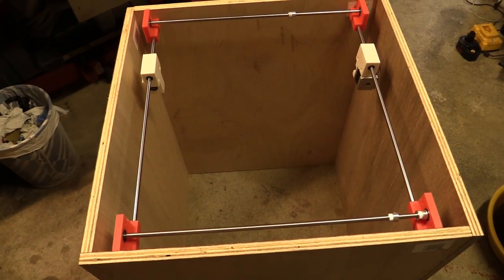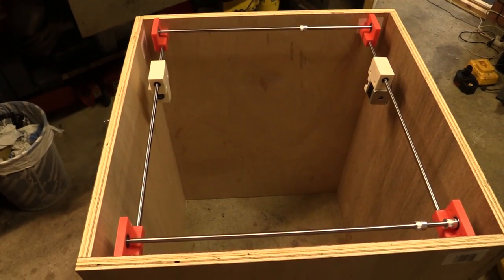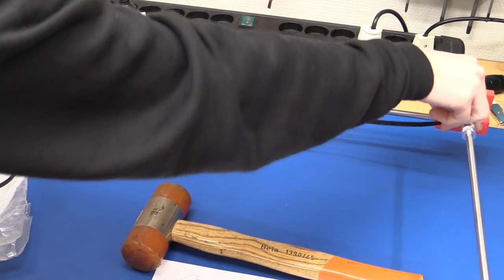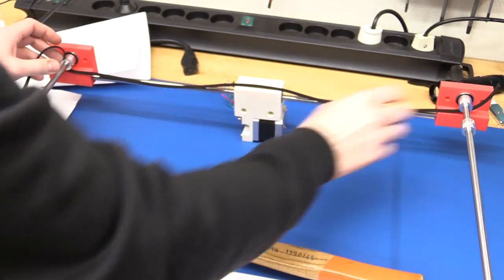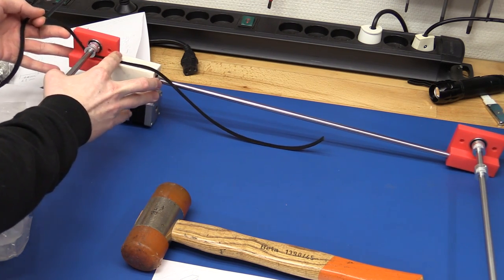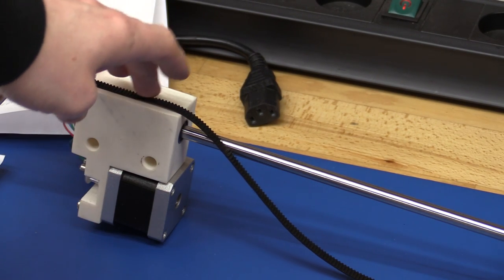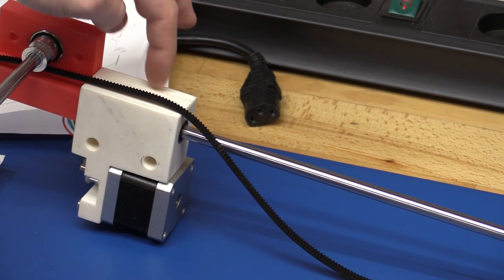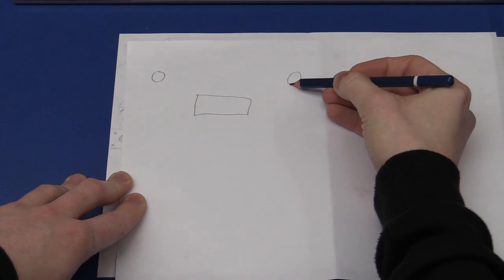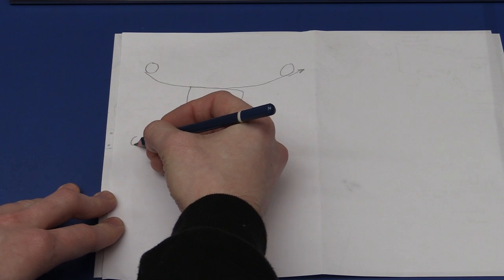I finished the box and it seems to fit. I'll pull this back out and look at how it all fits together with the belts. What I want to show is that when the belt engages these teeth it should be at the same height as this, so when the block is pulled sideways the belt stays level — that's important. I'll make a clamp to hold this in place on top of the block, screwed into the plastic.